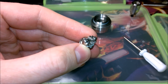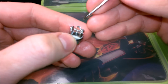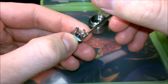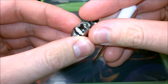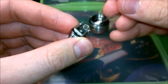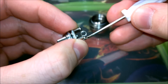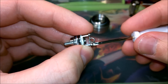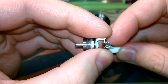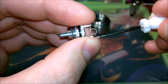Once it's in place you need to tighten the screws very gently on either side. Just tighten the first one very gently, then push it over a little bit to line it up, and do the other one. Just tighten them a little bit at a time, because if you do one too tight you won't be able to move the coil over if it's in the wrong place. It's quite important with this to have the coil central, from previous experience. Use a screwdriver to drag it over a bit, then tighten it.